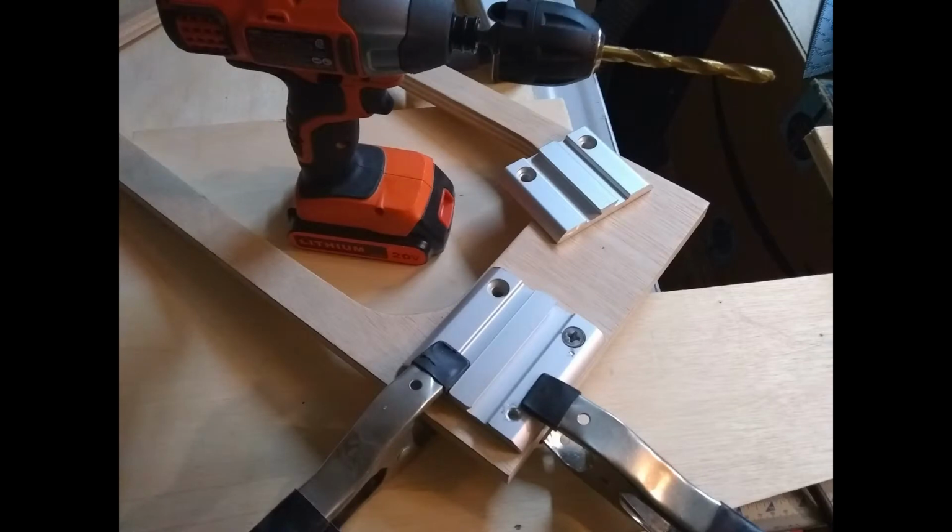For the lagoon table mount, I thought that I could get by with actually less of the mount and wound up actually cutting it in half on my table saw. Even though it's pretty thick aluminum, you can cut aluminum on a table saw. You just need to raise the blade slowly and make several passes at it, cutting just a little bit each time.